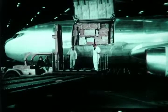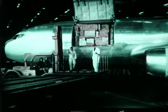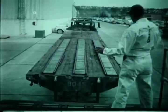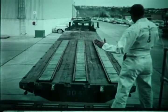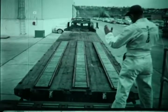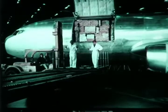This system utilizes standard external roller conveyor components, which can be attached to and removed from the forklift platform and any truck bed. The roller conveyor units in the aircraft are designed to utilize existing tie-downs. Consequently, they are quickly and easily removed or installed in the aircraft. A small, readily trained crew is all that is required, since all cargo pallets are moved on free-running rollers. Inside the airplane, palletized cargo is tied down on the rollers by pallet-spaced stops and side rails. No other tie-downs are required.